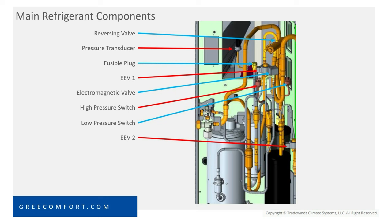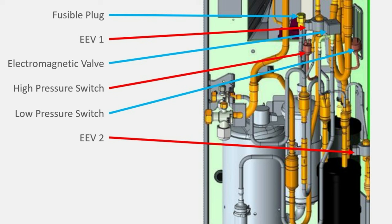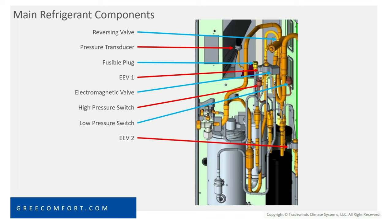If you look at the indoor coil on the Flex air handler, it has strainers on both sides of that TXV as well. So if you're using an existing line set and you put a two-way dryer on there, that's not a bad thing, because if you start it up in cooling mode, if there's any debris in there, it's going to channel through and hopefully get picked up in that liquid line dryer. My caution to you though is, if you have anything in the suction line, it's going to end up in that strainer in that outdoor unit that I'm showing you right there.